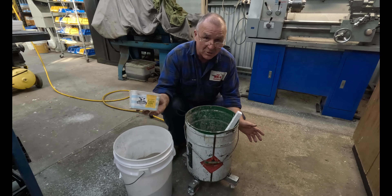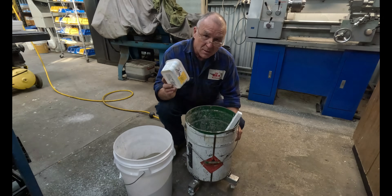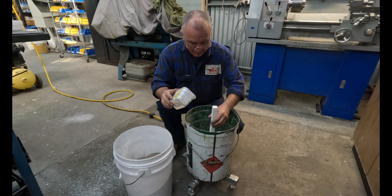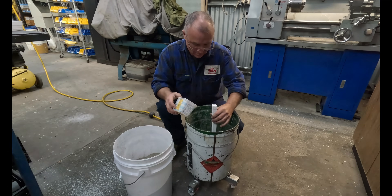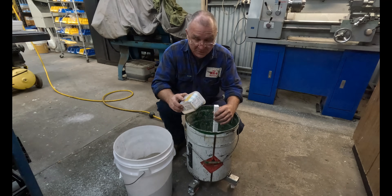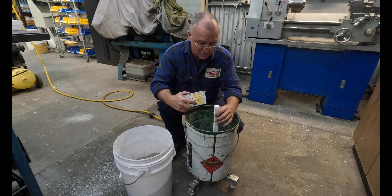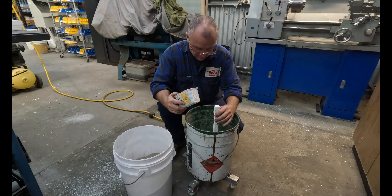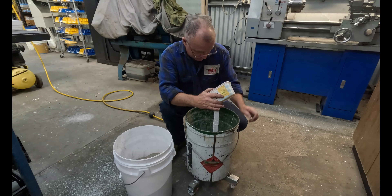It's about to get a little bit noisy here because I've got the air vibrator. What I'm actually doing now is setting our mould in the sand — I'll just turn the vibrator on and keep tipping sand in slightly so it all packs in nicely. Obviously I can't talk while this thing's on, so we'll get onto it.